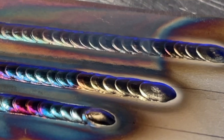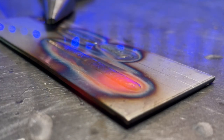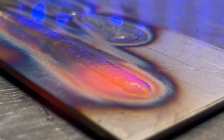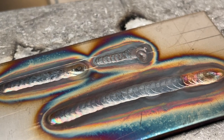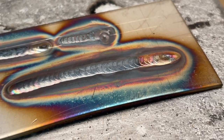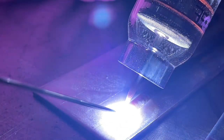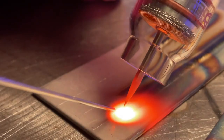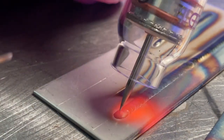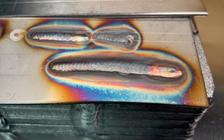The tricky part is not pulling the gas away too soon. Removing the gas too soon is going to cause the oxide to form right away and cover the welding area completely — and it's going to look super gross. This is what happens when people are experiencing overly gray or dull welds — it's excessive oxide that has formed. As we come towards the end of the plate, supplying this area with insufficient gas will cause heavy oxide to take over, and this is what turns gray and makes your welds look really bad. Yuck.